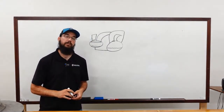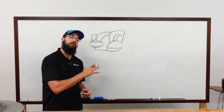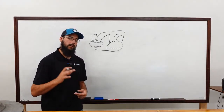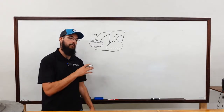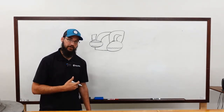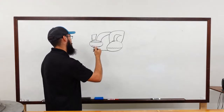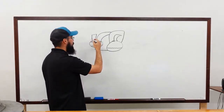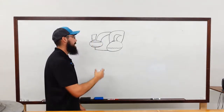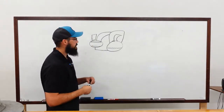If you saw one of my shorts the other day, I made a mistake and accidentally referenced the entering water versus condenser saturation. What I meant to say, and I'm saying now, is that it's the leaving condenser water versus the condenser saturation that gives you your approach value. When that approach value begins to get high, that could be an indicator of atmosphere in that system. So you would need that purge assembly to be able to pull that back out of it.